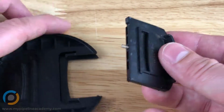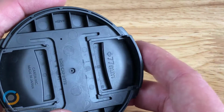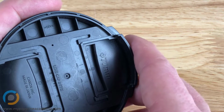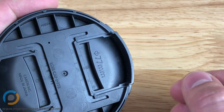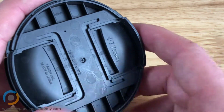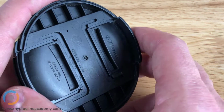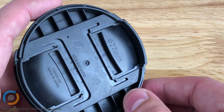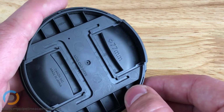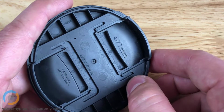And now, when the factory worker puts this together, you'll see, look at the interaction right here between those little kind of hook features. Now it clicks in place and it's done, and you don't have to use a screw or some kind of fastener to hold it in place. This is a great example of design for easy assembling. So why is this better than using a screw? Well, a screw takes additional time, and it's an additional part, so there's going to be a cost associated with the screw that you just don't have with this integrated design.